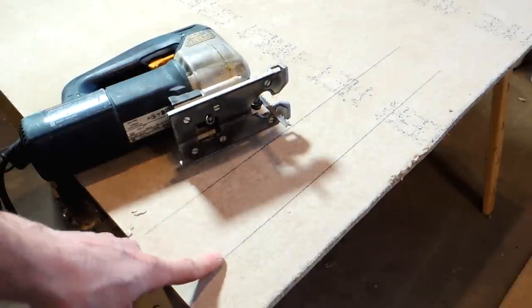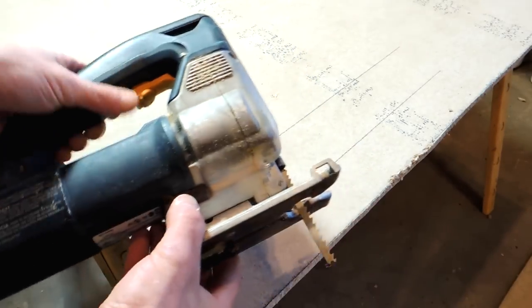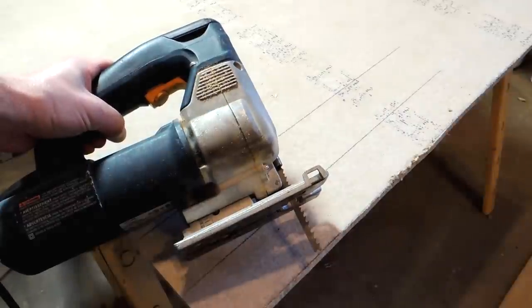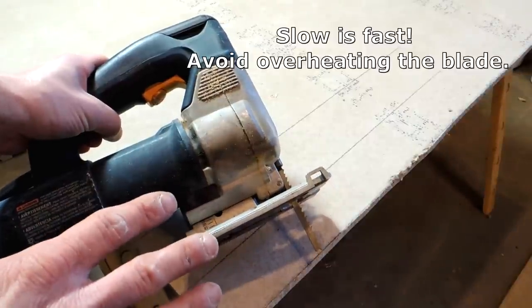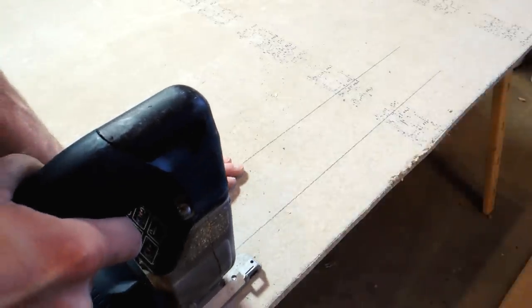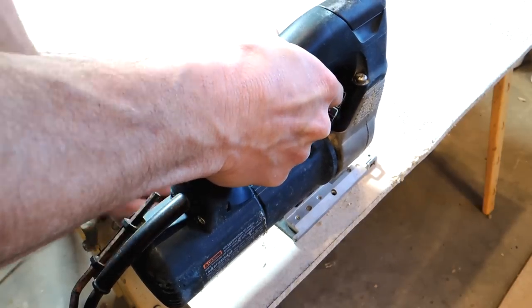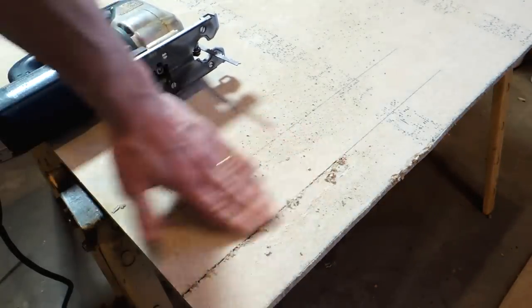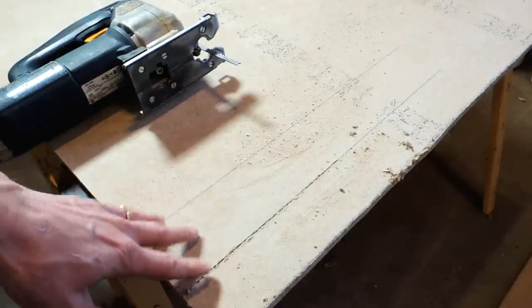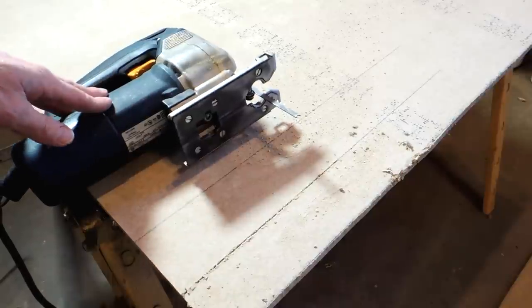I've drawn a couple of lines here which I'm going to cut on. First up is the jigsaw. I'm using a very coarse blade, and I'm setting the jigsaw to use an orbital action — so it's not just straight up and down, it's got a slight orbit to it, and that does help cut this material. You have to move very slowly with this, so it's not a speed demon, but it does get the job done. [Cut demonstrated.] A little bit of dust, but not too bad. A very minimal amount, and it's a nice clean line. I use this pretty often, and if I'm cutting a curve it's definitely the go-to tool. It's also always in my trailer, so I don't have to carry around a dedicated tool.